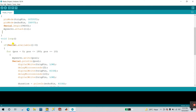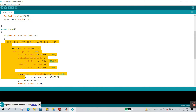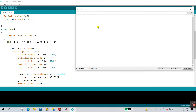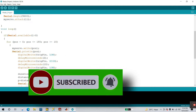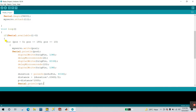Now let's come to the void loop. If serial dot available — now if the serial monitor is available, that's when this function executes. Anything like when I click this one — you see right now it's not working. We need to enter any value or any character. Like click enter and now you see it's working. That's why we declare this code: if serial monitor is serial dot available, that's when this condition executes.